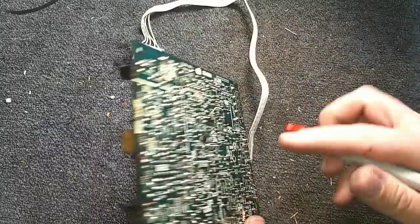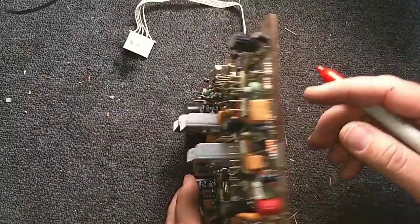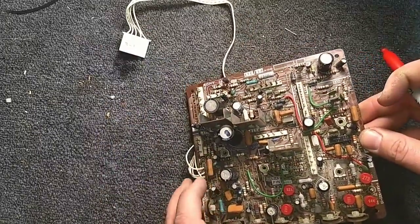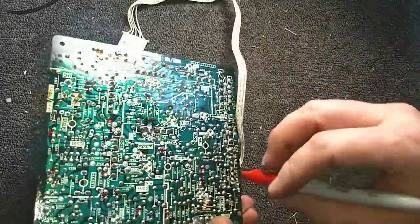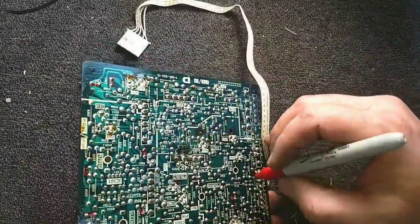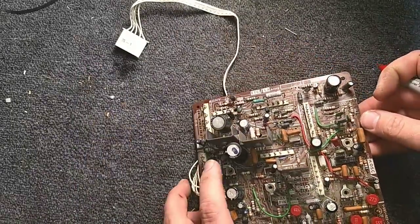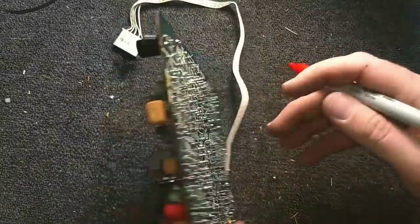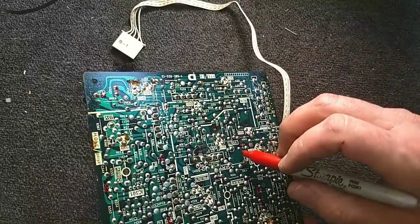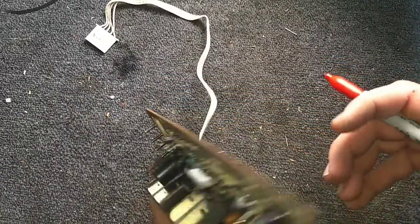This is kind of one of my keeper sets, because I wanted a nice Trinitron. I've always had like beater ones where the CRTs are dead and they don't rejuvenate, by the way. So if you get one with a dead CRT, just move on. I've never had a Trinitron successfully rejuvenate, ever. If you're really lucky, it'll go arky sparky when you turn it on and hurt something after you try to rejuvenate it. I guess it's just how the guns are designed.